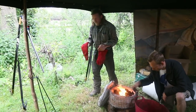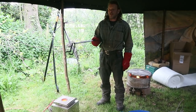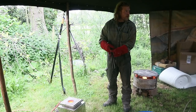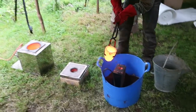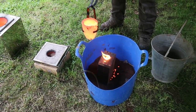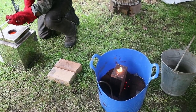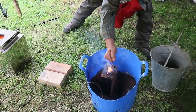Now you'll be doing this twice today. Have a presence of mind when you're using these — put your hands on the right way up so you can actually tip it. Once that goes, hold of the crucible — I'm going to have anything up to 2 kilos of bronze. Pick it up as a nice clamp, come over to here, and tip in at about that sort of flow rate. Everything's fine. Drop that back into that environment, as close to the middle as you can. Pop the lid back on gently, then turn that back on. Get a little bit of water and put that all out — so it doesn't burn the wood.